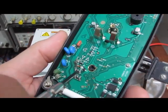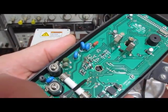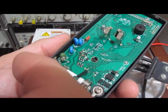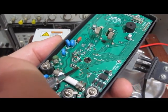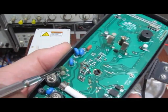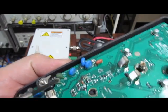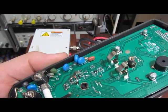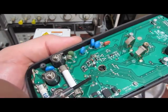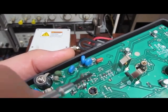Looking inside the Unity 139C, there's a little piece of fragment here at the end of my screwdriver — looks like it was a piece blown off of something. I would have thought it would be this little PTC here. It appears to be the same color, possibly from down by the lead. You can see there's some discoloration up here where it's been arcing.